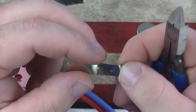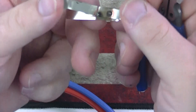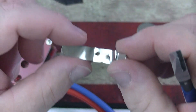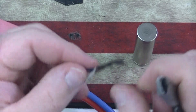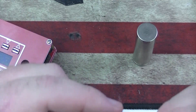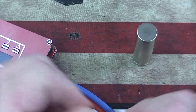I think we're going to be very surprised on what this welder will be able to put out, so that's why I'm starting at 20. Here's me playing around with this last week — you can see this burn mark right here, and you can see through these holes — it burnt two holes in this thing. These two pieces: this is 0.15mm nickel strip and this is something from a laptop, probably 0.15mm as well. So this welder is very capable of doing spot welds. Knowing that, let's jump right into 0.15 by 8 millimeters and see how scary we can get.